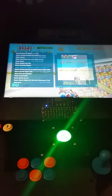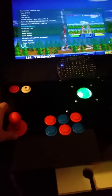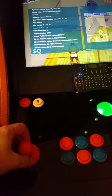There are a lot of analog games that require an analog joystick, but these are digital joysticks — they basically only have clicks, and you can't really rotate them in an analog manner. You're either pushing a button or you're not. Analogs are sort of like big potentiometers, like you're turning a knob. But I really wanted to play the old Star Wars games — like the original vector version right after the movie came out — so I mapped it to my trackball.